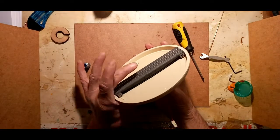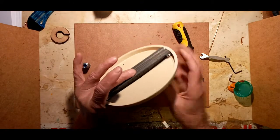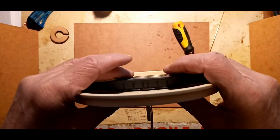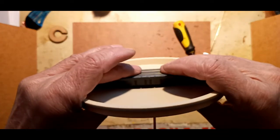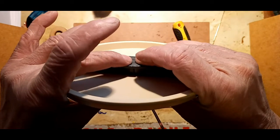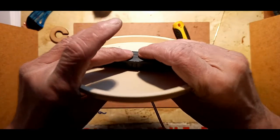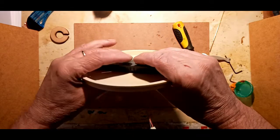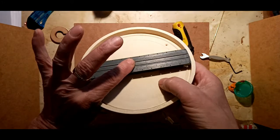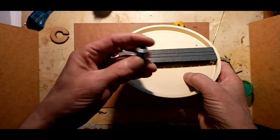Now if you look carefully and put one finger there and one underneath, you can squeeze it. In fact, if you use two hands, let's bring this up so you can see it. I can stress it effectively. So I'm pushing down on the turntable grey bit, and on the buff bit I'm pulling it up. You can see that it's moving up. Now, because we've got ball races on each side, we can pull those tight down together and it will still rotate really easily. So that's where this part comes in.